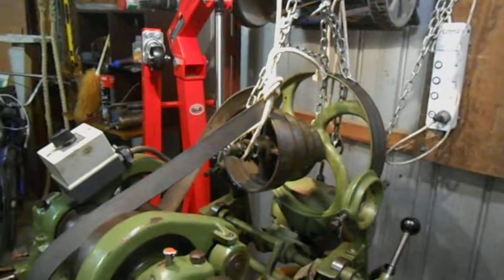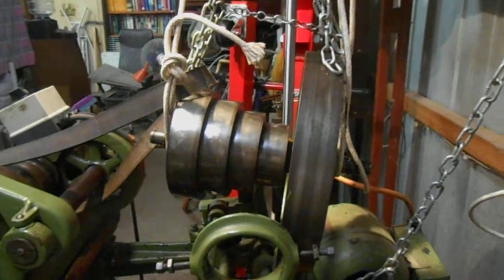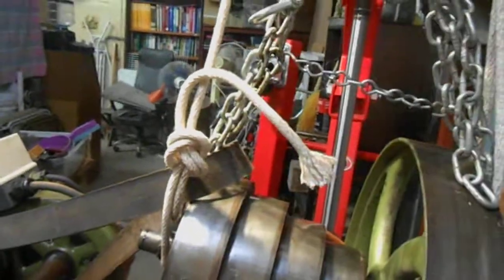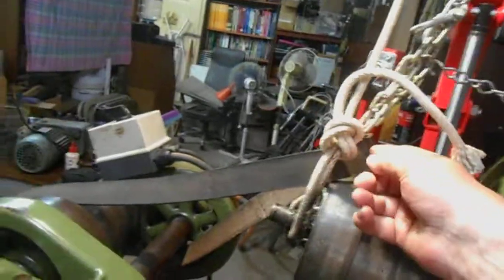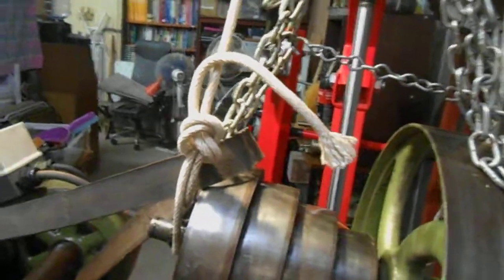And this thing, I reckon it'd weigh 100 pound, 120 pound. It's damn heavy. And so what I've done is I've put a second safety on here with the rope. So what I want to do now is lower that down to put tension on the rope. I've got a cross connection across here. Undo this thing here when it's got the weight, and then very, very carefully put it on the other side of that journal and then pull this belt out. This belt sits on the wrong side of the chain. But now I remember why I bought the crane.